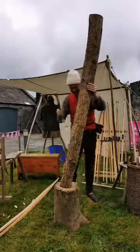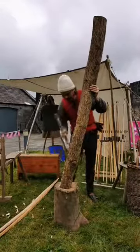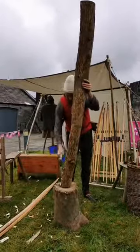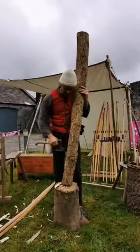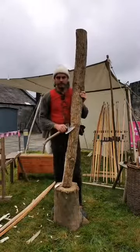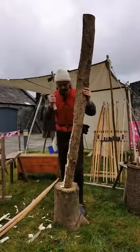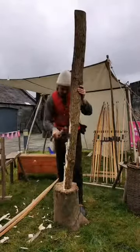Sorry if you're in the firing line. So you make some hatch marks up the side, which then allows me to come in with the side axe from above and the shaving will peel away just like that. You can see there are a good few shavings on the ground — a whole chunk taken off the side, in maybe 40 seconds or so. The rough shaping of the stave can be done quite quickly, although it does tire you out if you're not used to it.